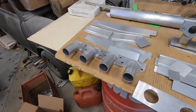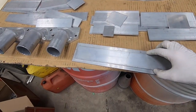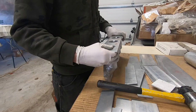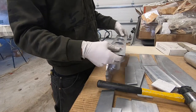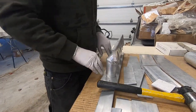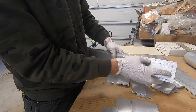The first thing I did was use the actual exhaust chamber plate to mark out exactly on the water box plate where it's going to sit. Figuring out how to make stuff work even with distortion is just part of the job. I had these lined up perfectly and they're slightly out of line but I can still get that on there, so that's good news. Now I'm going to sit this down on a flat plate and push it down until they're all perfectly even, then line up this plate with the scribe lines I've put on there.